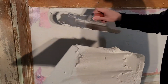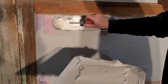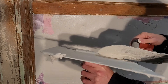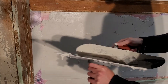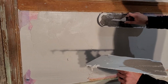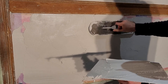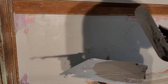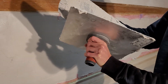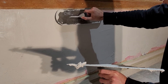You're never really flat on the wall with the trowel — you're always at an angle. You're pushing a little and then pushing less when you pull away. When you push, you want it to expand out and fill the areas around the trowel. If it goes too flat, you can create suction and mess up your area. That's all just practice.